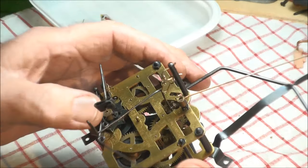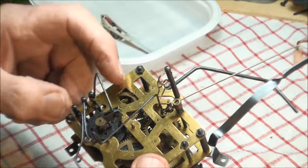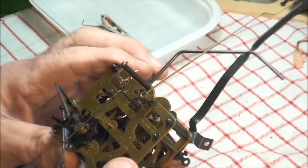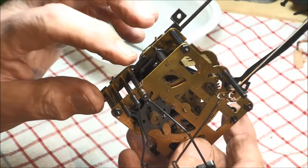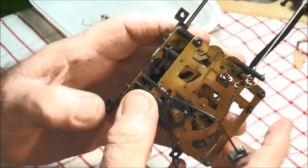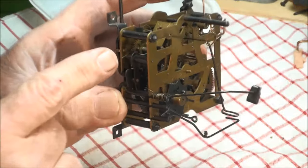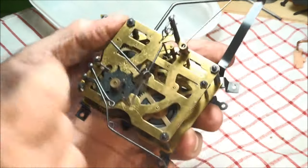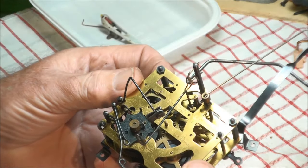the Cuckoo part of it has a star wheel. It's got a screw in it, and so this is going to be easy to time on that side. To time the actual cuckooing, I'll show you the gears inside there. And so, because it's got a warning gear in there, or a warning pin, and the warning pin is what you have to set this thing up so it cuckoos and is able to stop.